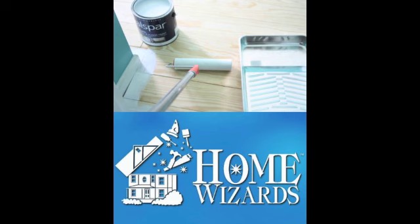You do two coats and you're done — the floor looks great. If you want something more durable, like for a lot of foot traffic with things sliding over the wood, you may want to consider epoxy, which is a two-part product — part A, part B, you mix two things together. Those can be tinted to any color. You roll it on and when it dries and sets up, it's incredibly industrial and durable. If you use porch and floor enamel paint, it will scratch if you slide big heavy things across it.